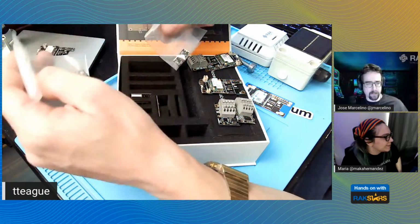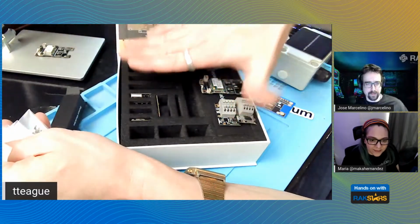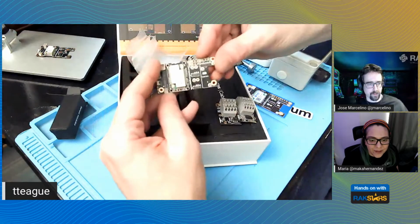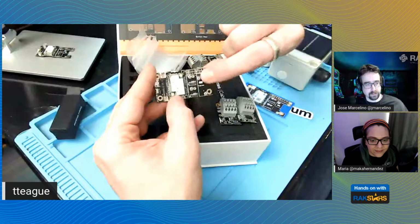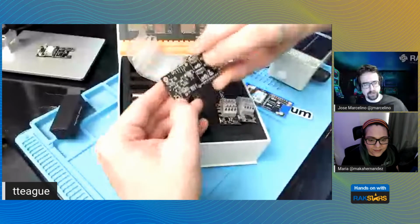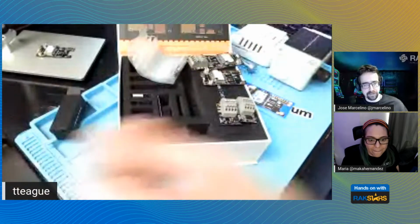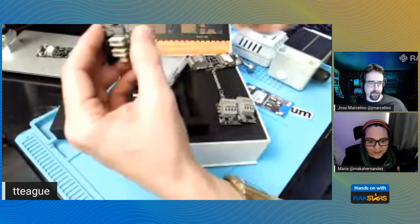There's also another one that gives us a 3-axis gyro, and so I can have a sense of the orientation of the board. There's a dedicated temp and humidity sensor. You've got a lot of these little sensors, and what's cool here is on the board, if you look at where these modules mount, I have this over here, which is going to be our I/O for our larger sensors, and we'll get to another one in just a moment. But these connectors here, I have 4 of these on board. And so I can put 4 of these small sensors, or a couple of the other ones that we're talking about in a moment, on board and use all of them at the same time, right? Yep. Yeah, that's right.